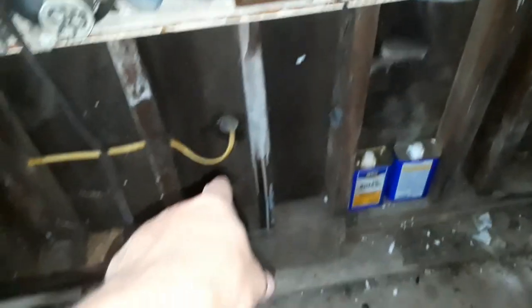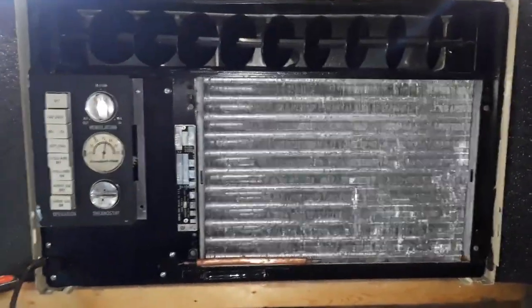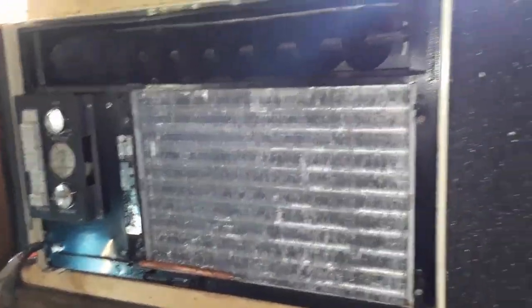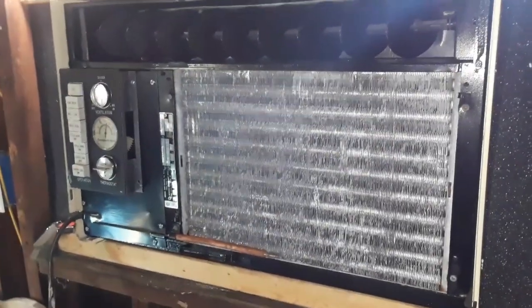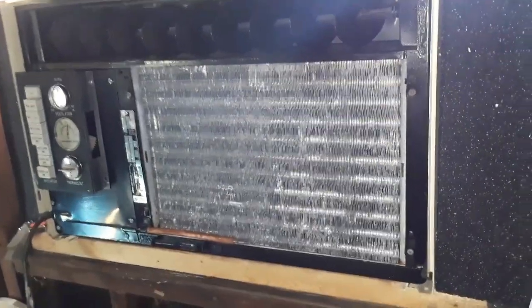She's 100% in. I do have it plugged in but I don't think I'm going to run it like that yet. I have to move that 220-volt outlet over to the Fedders, and this is a 110-volt line that goes to my fire pit with an electric wire on my fire pit. I'm going to cut that and put a j-box in there, splice it up, and put a 110-volt outlet here for the Admiral. Then we're going to fire it up for the first time — fire it up with the grill off, pause it, put the grill back on, and we'll get a full view. I'll stop it and when I get back we'll merge the two videos together with that software I have.